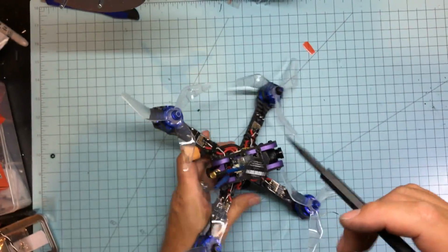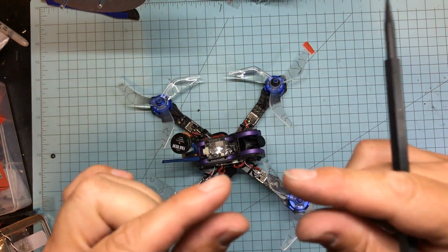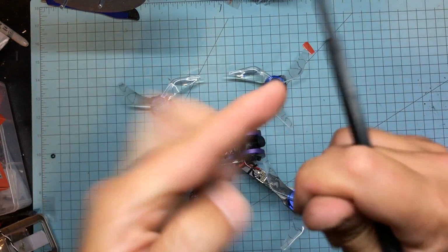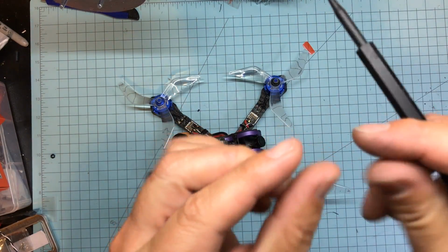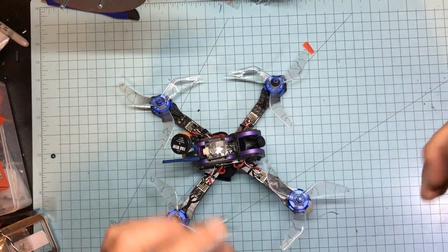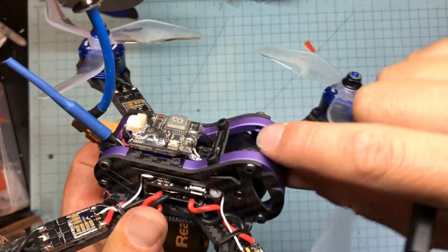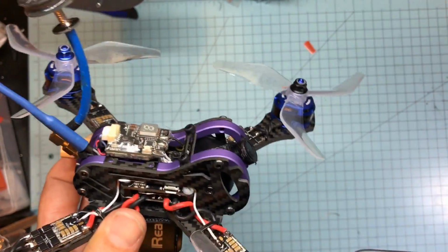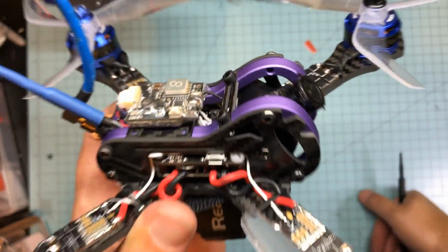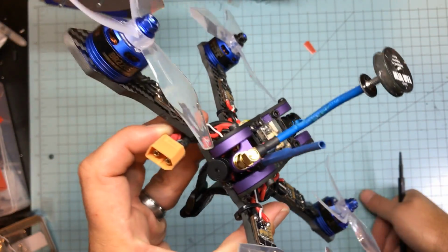And I take good Scotch tape, the clear Scotch tape, not that foggy stuff, the clear stuff, and I wrap one strand, yay wide, just a bit of it, halfway around the lens, and then I screw the lens back in. It's super, super tight. So wherever you find your focal point, it just stays there. You don't have to hot glue it. You don't have to Loctite it. It's a really good trick. I recommend doing it. It works great.